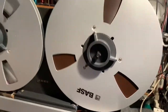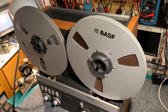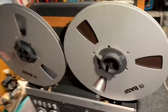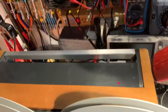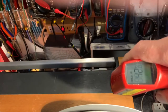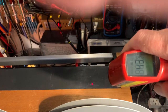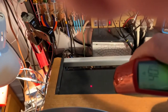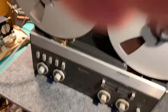It's been running all day since I put the case back on it. This is the second tape that's been pulled through it — 10 and a half inch reels. The case temperature above the motors: the take-up motor is about 42–43 degrees and the rewind motor is about 40. So very, very comparable.